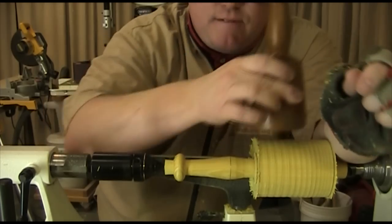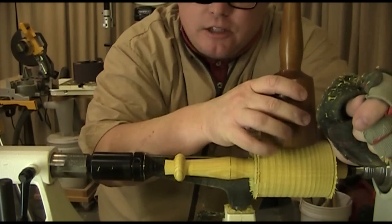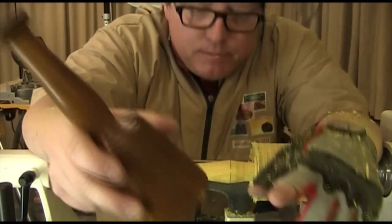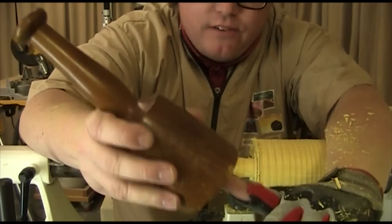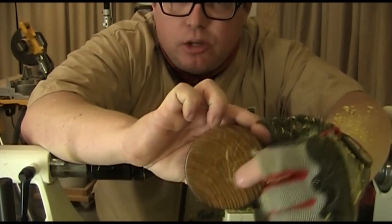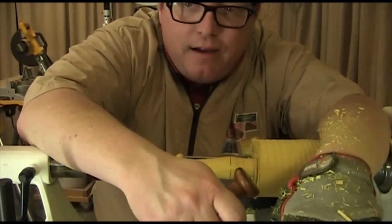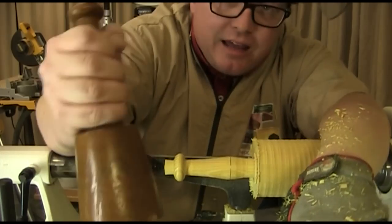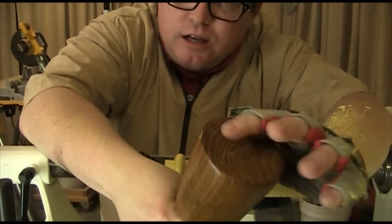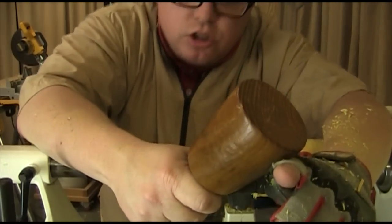That way, it will sit flat when I lay it on my bench. Also, it allows me a third way to use this mallet, because I can actually do some minor carving by tapping on this end. Plus, end grain is so much harder that when I set my hold fast, a lot of times I just bang it like this. So having that little concaveness has multiple functions, and I'm going to set that with my skew chisel.